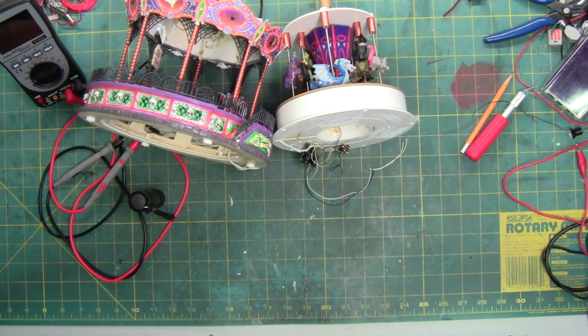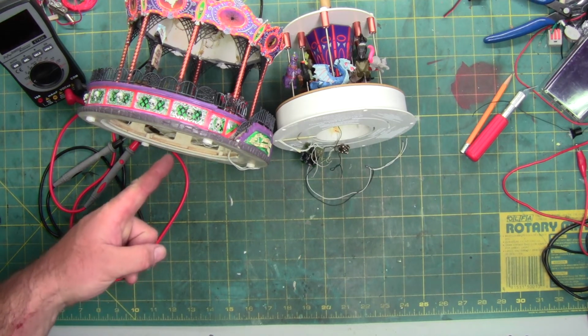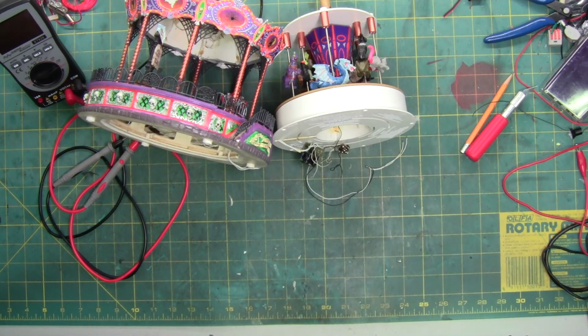So this one is going to be a little bit more difficult than the other ones because of the small little fires, quote unquote. But we're going to continue. I'm going to test out the circuits and see if the little flip-flop circuit can handle 6 UV lights, because UV lights draw a lot more power than a standard red or green light. So, if it works, I will swap out that chip up there for something that is functional, and then we'll work on the rest of it, and then we'll have to deal with that broken gear and see what we can do about that. So, shall return.